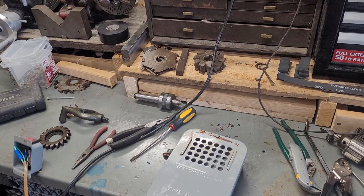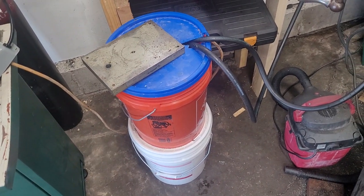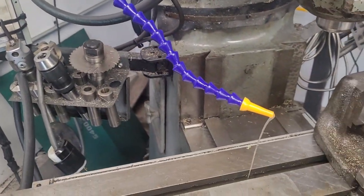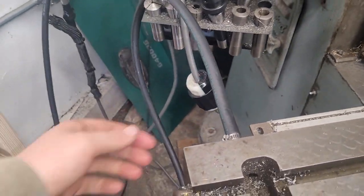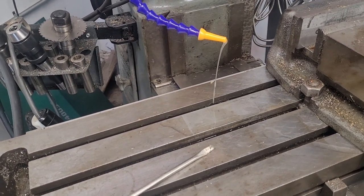We're just going to show you how the pump works. I've already put drains in my mill — one drain at each end of the table — and I'll show you how everything works and where we're going to put the sump. Here is the arranged flood coolant system. I think I'm going to lift the sump up a little bit — this pump doesn't have quite enough head pressure to give me a lot of flow; it's kind of a dribble with the valve wide open. I'm using 3/8 inch fuel line for the supply and the drain, as that's what I had around.